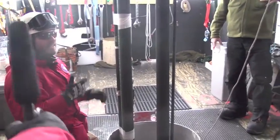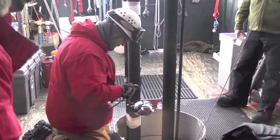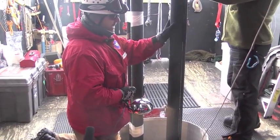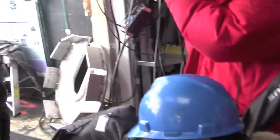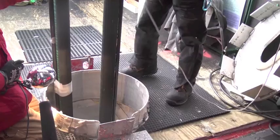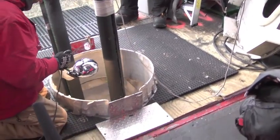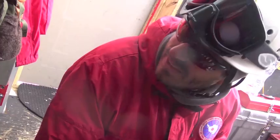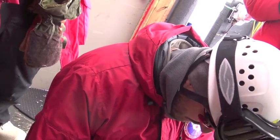Hold it like this or get the strap on, because whatever goes down here isn't ever coming back. But if you come over and want to take a look, I've got the light here. You can hold your hand on this hose — this is the actual drilling happening. It's 88 degrees C; put your bare hand on it if you want to feel the warmth. 200 gallons a minute, at this point probably 800 to 900 pounds per square inch, and all that water is going out a nozzle basically the size of your thumb. This hose is attached to the return water pump — you can actually see the water down there, establishing the entire loop. Hey Misty, how deep are we now? We're at about 1,440 meters. So this is the top 50 meters, with another 1,400 meters underneath that, and then another kilometer to go.